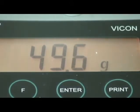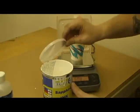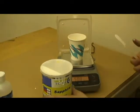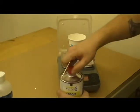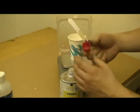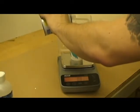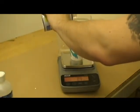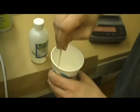You will need 60 grams. Zero out the scale again and add the hardener. 5-7% is enough. You always mix the ink and hardener first, then the thinner. The order is important for getting a good mixture of ink and catalyst. Mix the ink and hardener well.